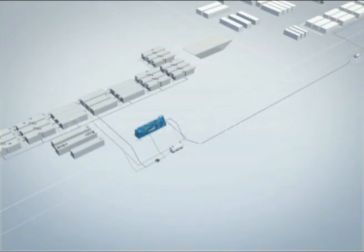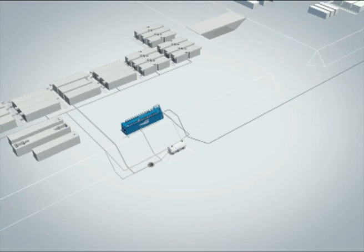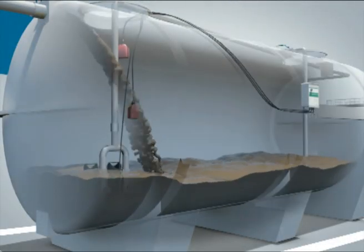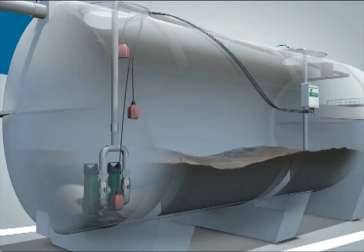Process walkthrough. Wastewater from camp communities flows to an on-ground collection tank. These tanks come with two pumps, both controlled by level switches mounted inside the tanks.